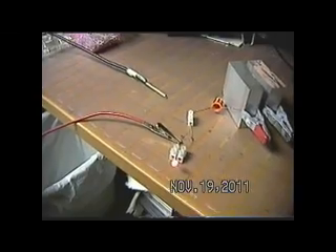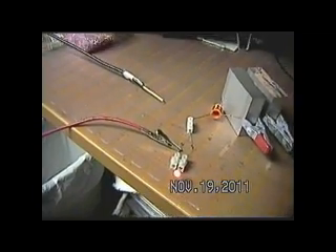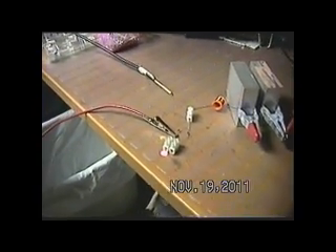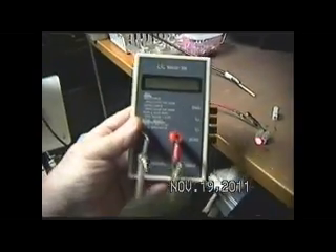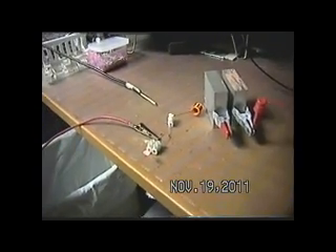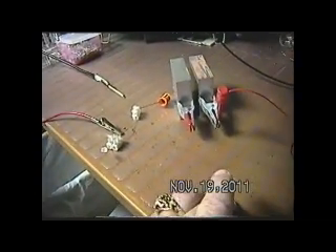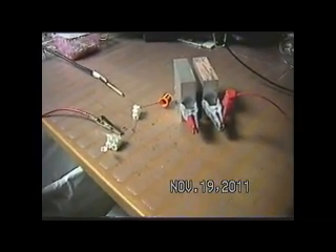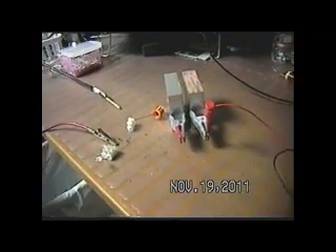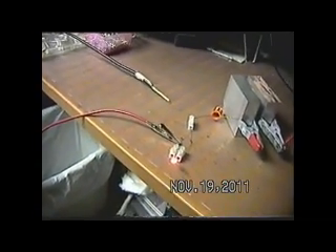So what you want to say is: what's that mass got to do with it? I've asked this question before. I've taken and measured — you can calculate the capacity with the measurements I gave you, if you want to do it that way. Also, I use this instrument right here, which is quite accurate, and I physically measured the capacity of those two blocks with the signal generator disconnected, and it came out to measure 9.71 picofarad. And 9.71 picofarad comes out to something like about 372 ohms of capacitive reactance at 44 megahertz.